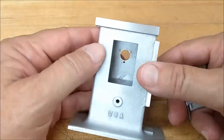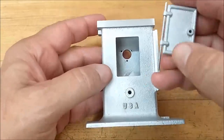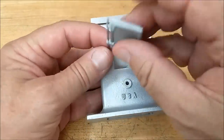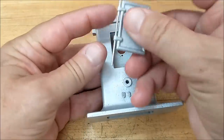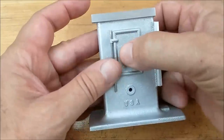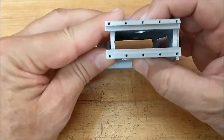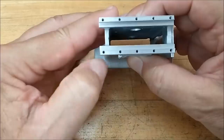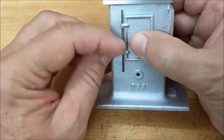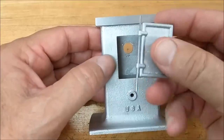For anyone that's confused as to exactly why I removed those lugs and what I'm up to now, well, here's the door that goes on here. In position. Let's first look at the way this is drilled. That hole is pretty dead spot onto the center of that boss. Now if you take this hinge pin and you project this hinge pin vertically, you can see that it crashes into the outer rail here. So basically there is no way to drill the supplied features on the body casting to accept this pin. It's just not going to happen.